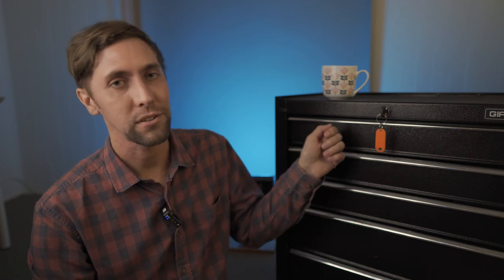One last important thing to mention about workshop trolleys: keep the weight towards the bottom — keep all the heavy things in the bottom drawers. You don't want this tipping over and damaging all your gear. Particularly the smaller workshop trolleys, they're a bit narrow so they could potentially tip forward when you open a drawer. If you've got a heavy drawer coming out near the top, the leverage might just pull the whole trolley over. So I've kept all my heavy stuff down the bottom and it gets progressively lighter as you go up in drawers, so opening the top drawer won't cause it to tip over.